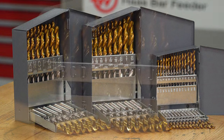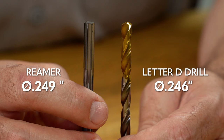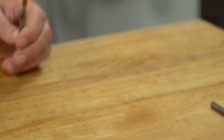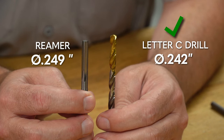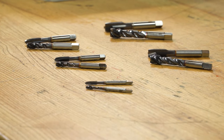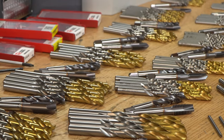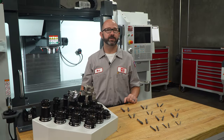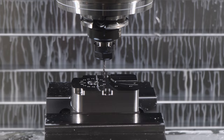We can look on our drill chart to see all the sizes just smaller than quarter-inch. A letter D drill is 0.246 inches in diameter, which would leave us 1% of stock to remove — this isn't enough; our tool might just rub instead of cutting, causing the reamer to wear out quickly. A letter C drill at 0.242 inches is going to leave us about 3% of stock to remove by our reamer — that sounds just about right. This kit comes with a lot of drill bits, and we will need them. For our tap drill sizes, we have added extras to make sure that we don't run out and don't get stuck using an old worn-out bit for pre-drilling tapped holes. A dull drill bit will take more power to cut and create more heat, which can work harden our material and cause tapping problems.